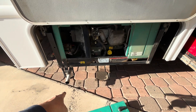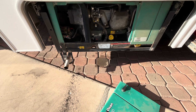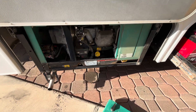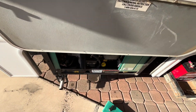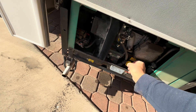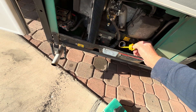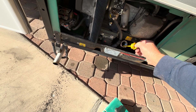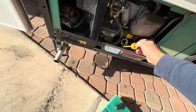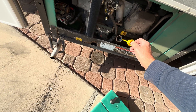Some of the videos said 1.6 quarts, which is way too much for mine. When I put that in there, I was blowing all this white smoke — you can see all this crap coming out of it. It just did not want to run at all. It was horrible. At 1.6 quarts, the oil would come up to about right here, and if you tried to pull the dipstick out, the oil would just flow out. It was way too much.